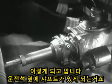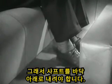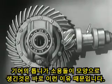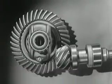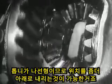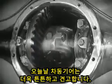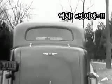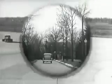A shaft in the middle of the floor of an automobile would be inconvenient for passengers and would be awkward for carrying luggage. Today, engineers have found a way to make the car roomier and closer to the road without a clumsy shaft above the floor. The drive shaft from the engine to the differential is lowered out of the way, and connected to the rear axle at the bottom. The new low center drive makes the rear axle quieter, stronger, and more durable because it gives better, smoother contact between the gears. The automobile of today, with the low center drive, is stronger and more rugged. Every part of the car is more rugged.